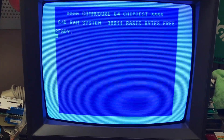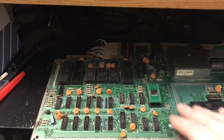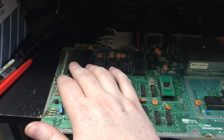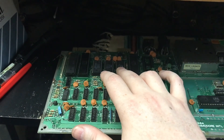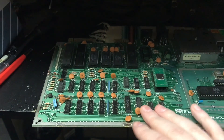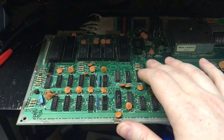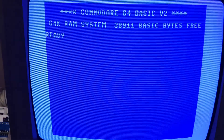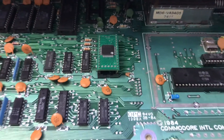That ROM looks pretty good — let's call it okay. It seems I may have been led down the wrong path. I pulled all the ROM chips and tested them in the chip testing board — they were all fine. I'd suspected the character ROM because I've seen a couple fail and give a similar pattern to what appeared on first boot. Anyway, I was going around pressing on the board to check for shorts, and I discovered something interesting: when I twist this socket forcefully and let go, it crashes. There's a pretty good chance the only problem is the PLA socket, so I'm going to remove it.